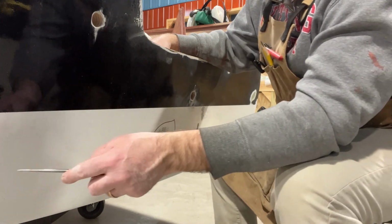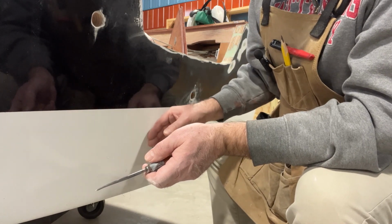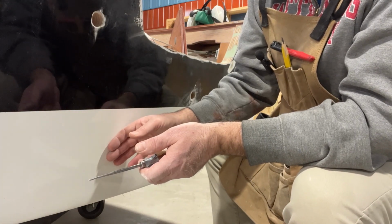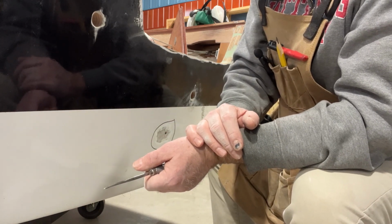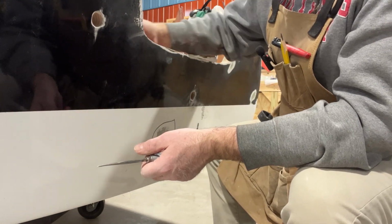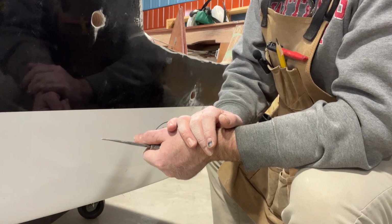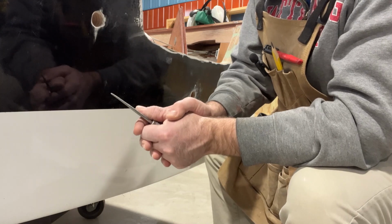I've also noticed over here, so there probably was an area that I didn't get clamped down, even though I had screws and washers when I put this together. I'm sorry, I left the skin on the boat when I first did the transom replacement and came in from the inside. So even though I probably put enough resin in there, I probably didn't put enough thickened epoxy to make that adhesion.